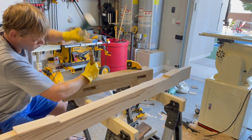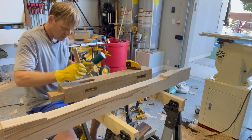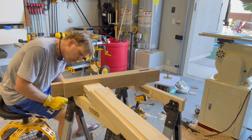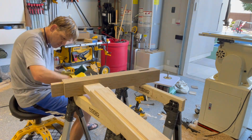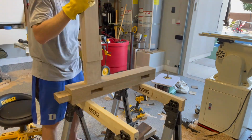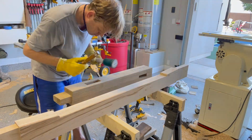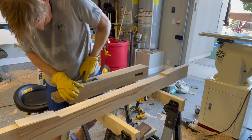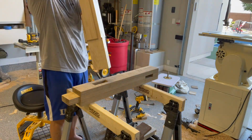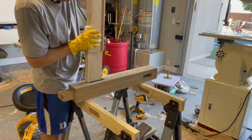So you have to be very cautious and respectful. You sit there for an hour and the board's binding up, and then you get that last little bit, and that's a 7 3/4 inch tenon, and it just flops right through, and it's a really clean shoulder fit and everything, and that's very satisfying. So we'll see that here as I keep messing around with the adjustments. There were four of them, and it took me over 6 hours to get the four, but I learned a lot.